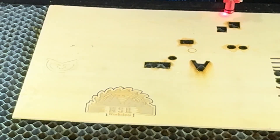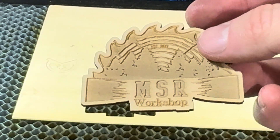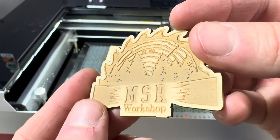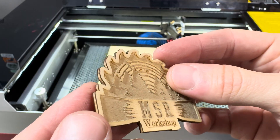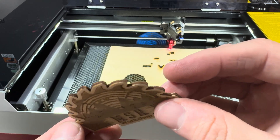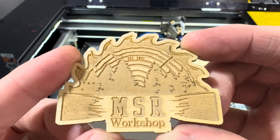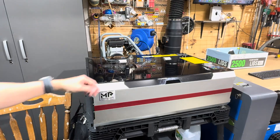I'll be doing another video on the air assist upgrade. So far this machine has done an exceptionally good job — I don't see a lot of charring or burning. The edges look nice and clean, it did a deep engrave, very smooth. I don't see gaps in the back and forth movement, which would indicate a loose belt or an issue with the code. Everything looks really nice and smooth, especially for plywood. Very impressed.